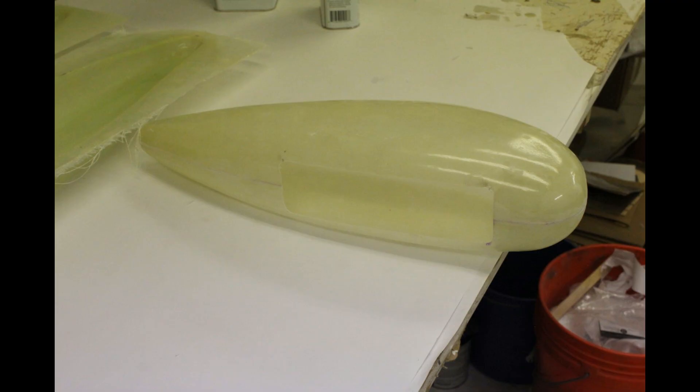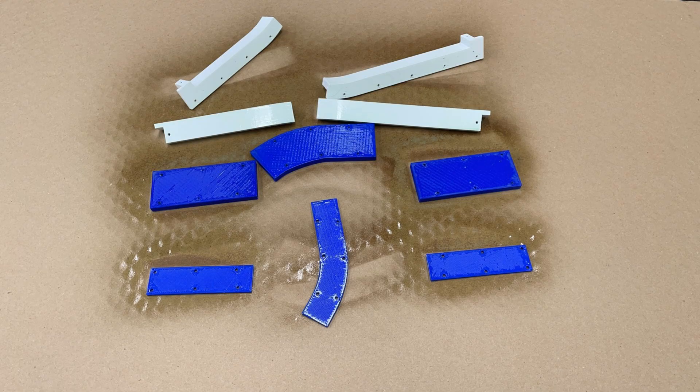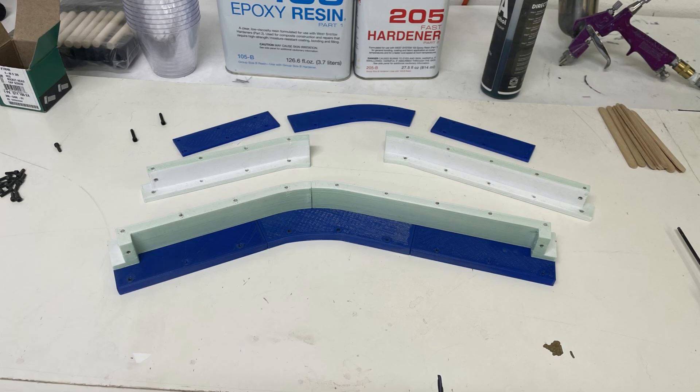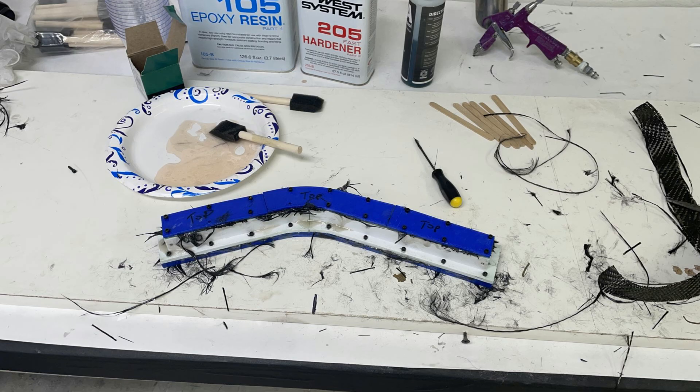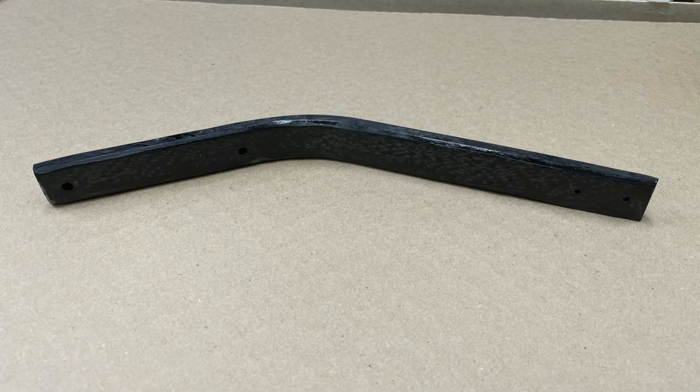Something about the tail wheel: I 3D printed some molds to experiment with laying up carbon fiber inside them. I sprayed all the parts with mold release, put it together, put in my carbon fiber, and squished and bolted it all together tight. It looks like complete garbage at that stage, but once you clean it up the finished product looked perfect — it worked perfectly on the tail of the airplane.